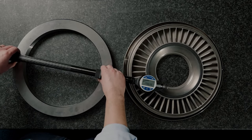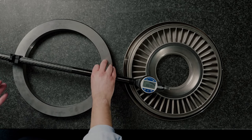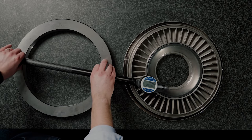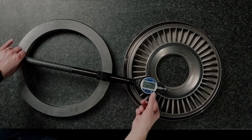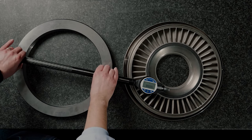Simply a case of placing the Universal Gauge in the ring and then holding the fixed carrier and using that as a pivot point, I sweep the carrier in this direction, looking for the point at which it's reading the largest diameter — which is approximately there. I apply set to apply the 300 millimeter preset, and then I can sweep again.